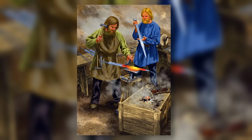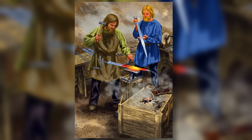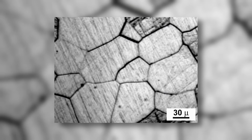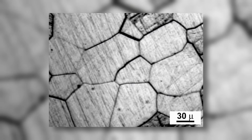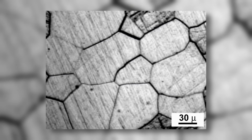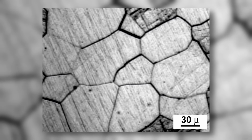As that metal starts to cool down from being heated up, it solidifies in pockets of crystals that grow outwards from a central point. As these crystals grow outwards and touch the border lines of the other crystals, it forms what is called a grain. And it's this crystalline grain structure that metals have that affect their strength in a large way, on top of just how strong the raw element is to begin with.